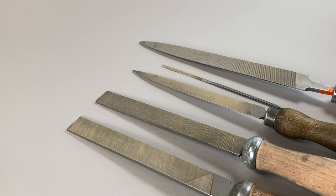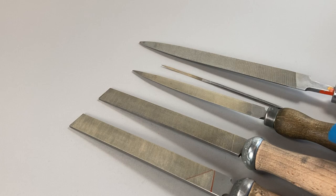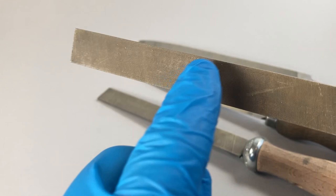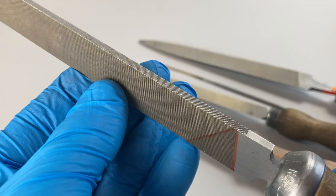So let's start with the question: which is your go-to file? Well, these all are really. The most common one where people begin is the hand file. The hand file is a straightforward rectangular file and it's cut on three sides — the two flat sides, one cut edge, and one safe edge. We'll come back to the safe edge a little bit later, but let's look at the cut pattern first.